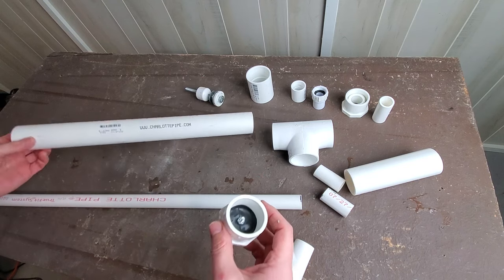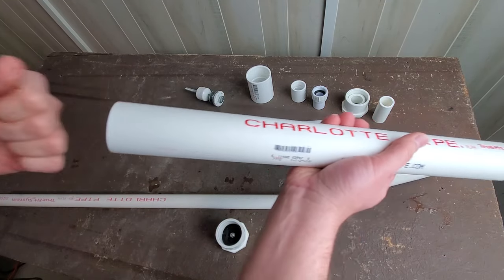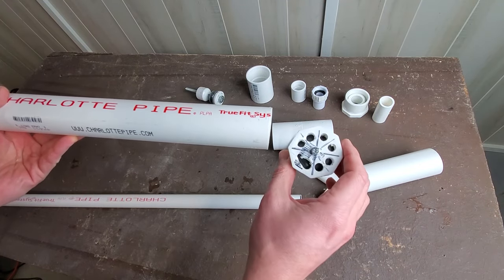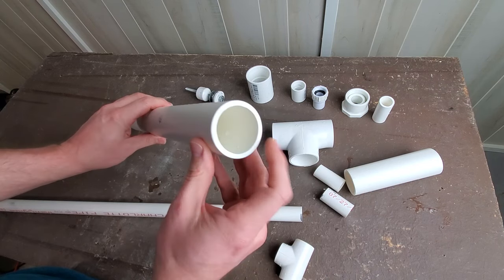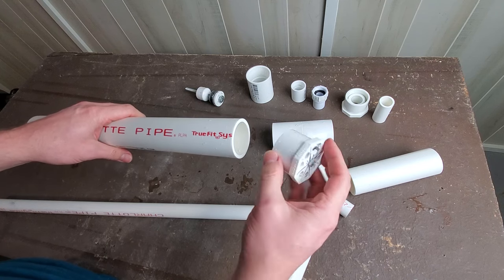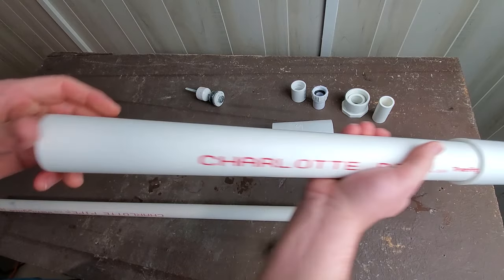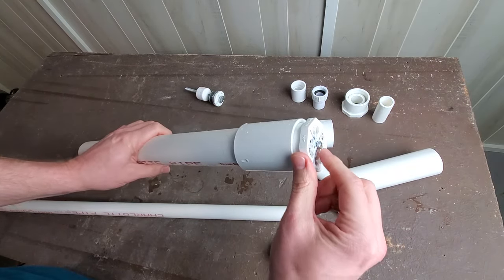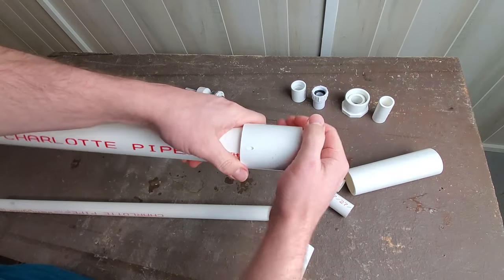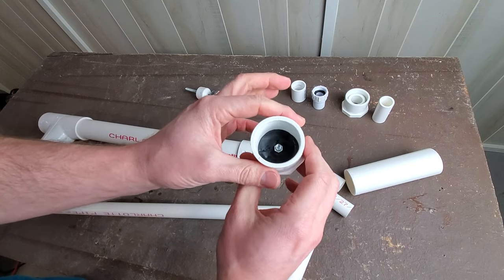We'll talk about this piece first. The main housing of the pump needs to allow water to fill it when you pull the pump out, and then push the water back out when you push the plunger back in. But as you push it in we need to redirect that water somewhere else. So it all starts with something that's essentially a very simple check valve. We're using one and a half inch PVC pipe for the pump housing or the body. This plug requires a coupler piece to fit on, so it goes like that. When you pull the pump plunger out this needs to allow water to go in, but since we want the water to come out from the spout when we push the plunger in, we can no longer allow water to move through this opening.